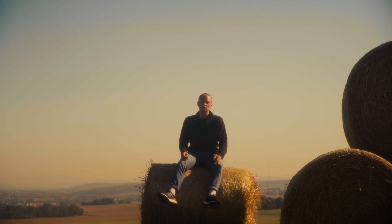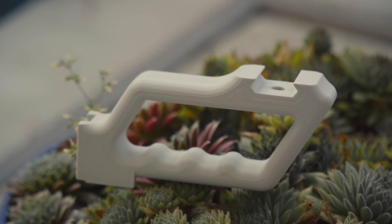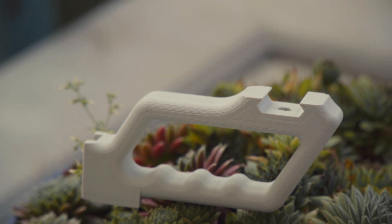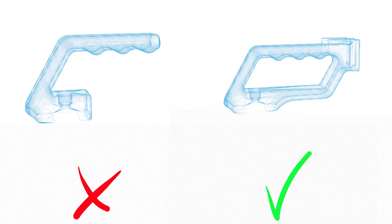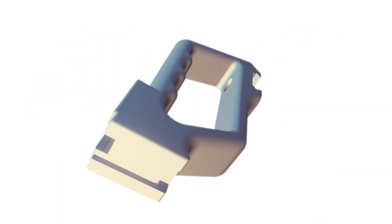After I had a base, I looked into designing a top handle and a grip for my a6500 cage. I started with the top handle. I decided to use a combination of NATO rail and quarter inch screw for mounting. I tried to design it without long unsupported levers. I added some finger grooves and torch mounts on the front, and that was it.